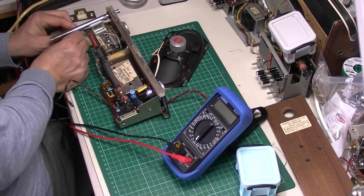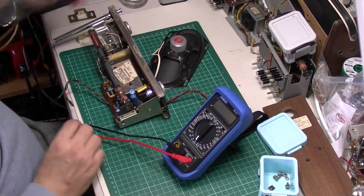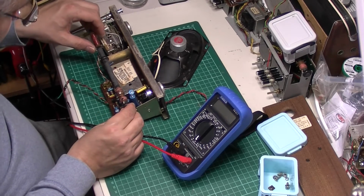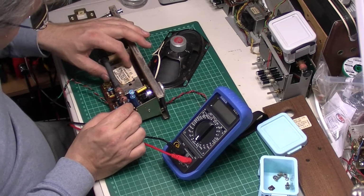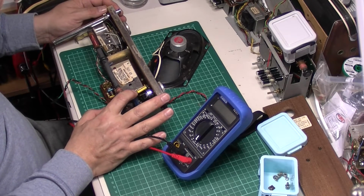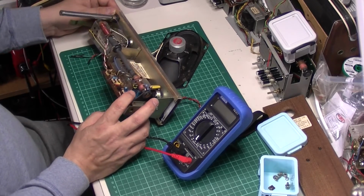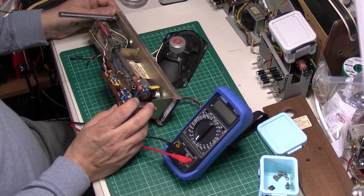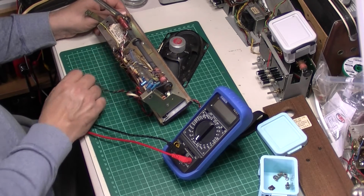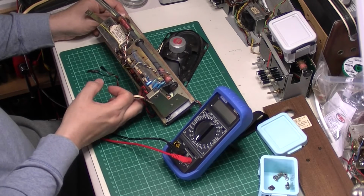As I say, this radio has been worked on before. It's not had a massive amount, I wouldn't say. So it's definitely been in here messing. It's got the lovely LP1171 module in it. These capacitors, which are in the power supply, are a little bit wonky looking, so they could have swollen up underneath. But as I say, it's unusual to have no noise whatsoever out of it. Normally there is a bit of a pop when you turn them on, but this one is absolutely dead.